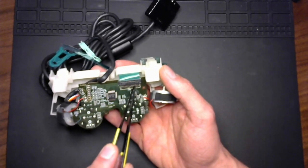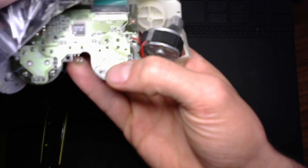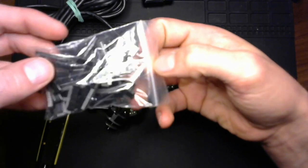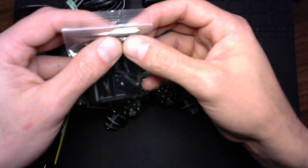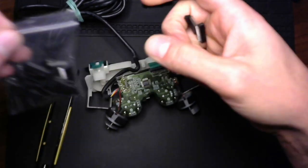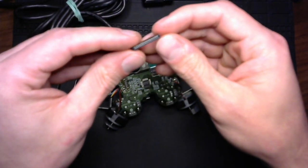And what we'll do is see if I can get a little closer to the camera. We'll have to desolder this and replace it with a new connector, which you can get from China, typically on AliExpress, for, if memory serves, something like 30 cents a piece. So we'll put a new one on there. And these are pressure fit pin connectors. So if we ever have to replace this again, oh no, then it's not something where you have to cut the cable off completely.